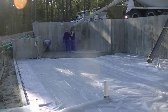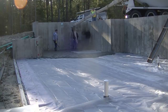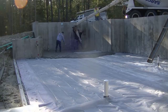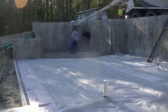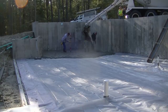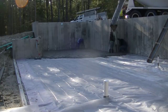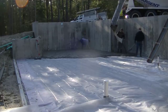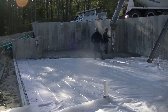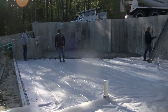We're using a 3,000 psi mix with fiber mesh reinforcement — that's a pretty standard mix for our concrete floors here in Maine. We pour it at about a 6-inch slump. A slump is how wet or dry the concrete is: a 1 is really dry and a 10 is really wet, so we like it right in the middle. I also use a water reducing agent — it's a chemical additive that lets me pour the concrete a little looser without adding too much water, which helps maintain the strength and integrity of the concrete.